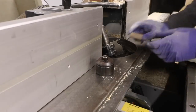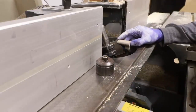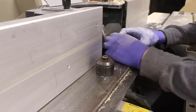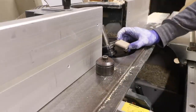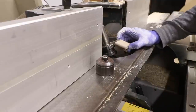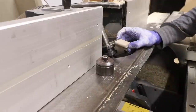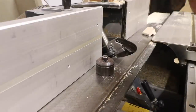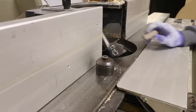I've got to mould the windowboard section of the lining. So I've got this cutter here that I used last time I did some windowboards here, and I've got to put it in this profile block and then just tilt that back until it gets to the right angle. This is actually an architrave, like an OG architrave cutter. It just does this cut about perfect. Right place there.